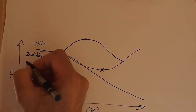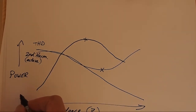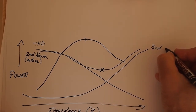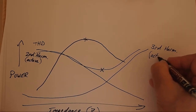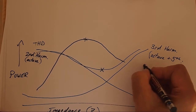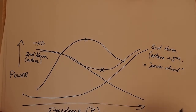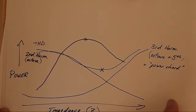The most prominent harmonics are the second and the third. The second harmonic is an octave; the third is an octave and a fifth. Even-order harmonics like the second tend to be canceled in a push-pull tube guitar amp, so the third is more of interest. Here's the second harmonic: it's at a higher level on a heavier load and drops off as the load lightens. The third harmonic, which is a more challenging type of distortion, is the opposite — fairly low on heavier loads, but as the load lightens with higher impedance, we see that third harmonic distortion creep up.